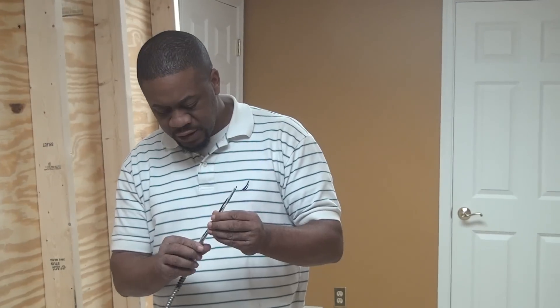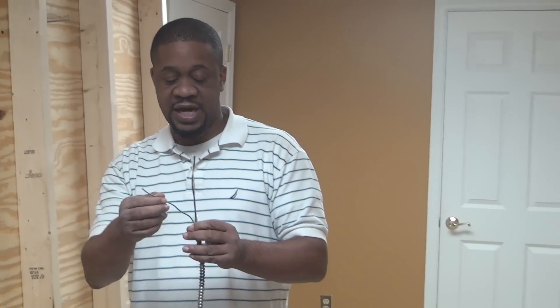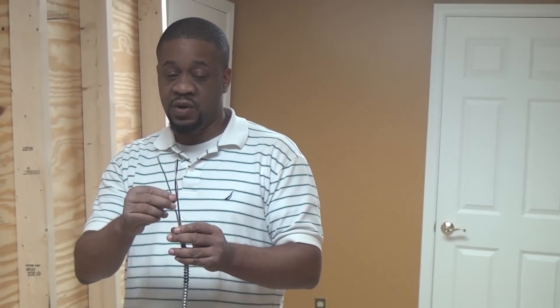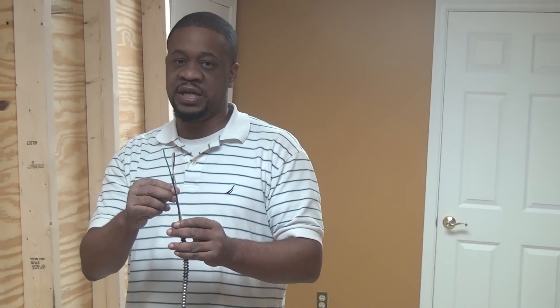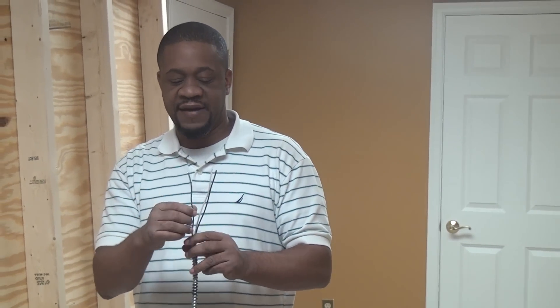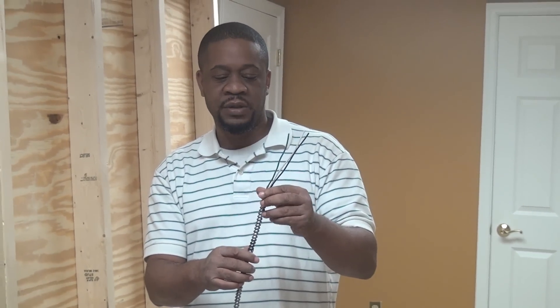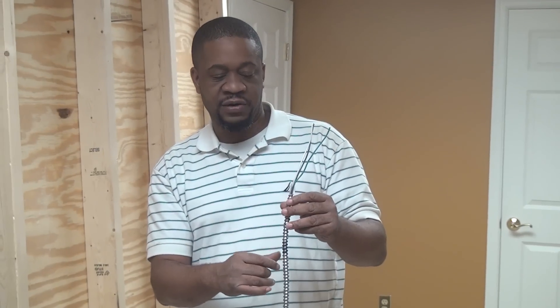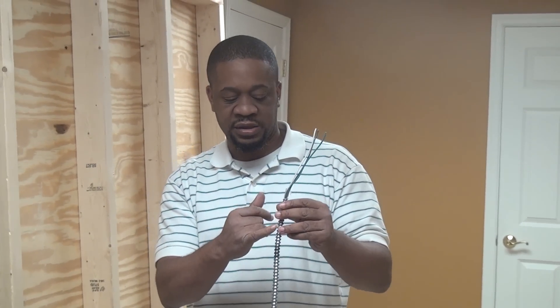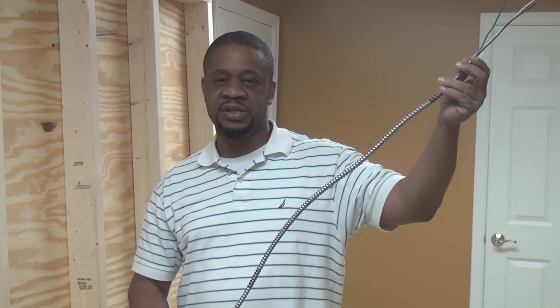It's a really good practice. That's pretty much it with MC and BX cable. Quick recap: with MC cable you're going to have an insulated grounding conductor — that's one way to tell the difference between MC and AC cable. With BX cable you're not going to have that insulated ground because the jacket of the cable is used for the actual ground. To ensure good ground continuity, it has a very small metal or steel conductor that runs along the inside of the cable.